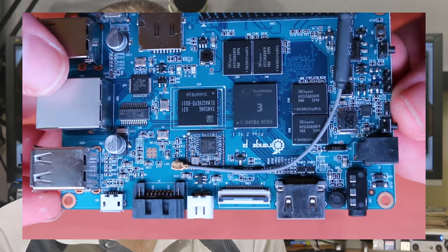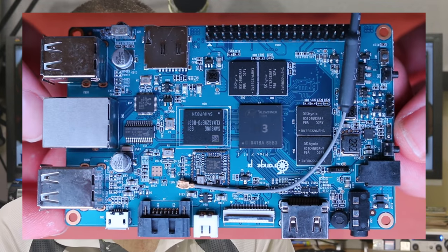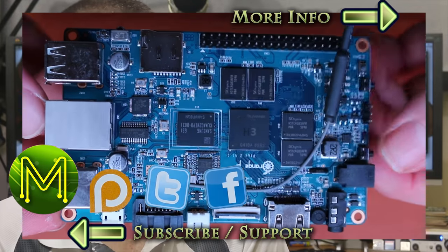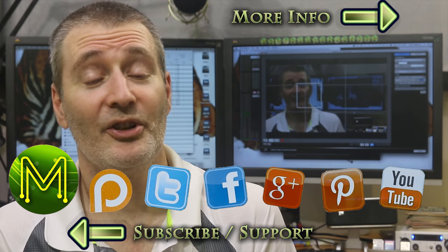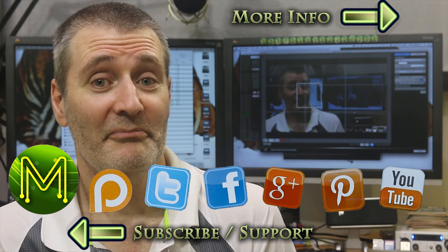Once I get my replacement board, I'll be running through all the tests I missed out on. I thought the Pi 2 Plus was a pretty decent board for the price. There are the usual overheating issues that saw the board perform poorly, but a proper heatsink would see it beat the Orange Pi Zero and the Raspberry Pi 3. As for software, just go with Armbian and save yourself the hassle. Thanks for watching — see you next week.